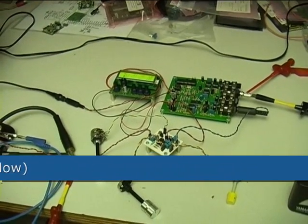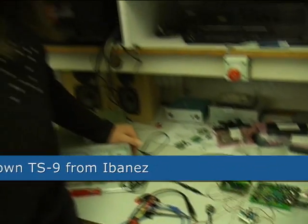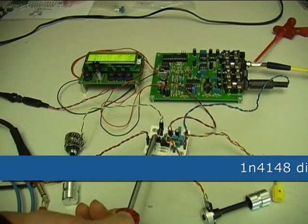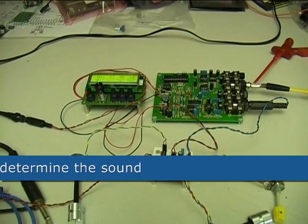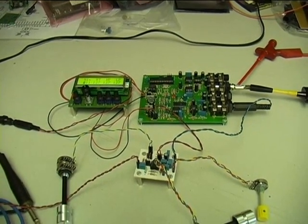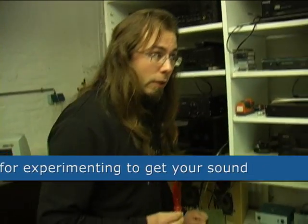It's based on a well-known Ibanez TS9 circuit, but it's a little simpler and really easy to build. We used regular 1N4148 diodes for the distortion, which you can exchange for a different sound. You can also swap the op-amp — we used the Texas Instruments OPA2134, which has a smooth sound. You can also use a TL-072, which is a little harsh, but it's up to you. It's very subjective what you use.